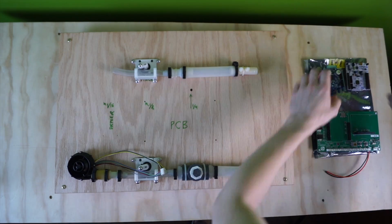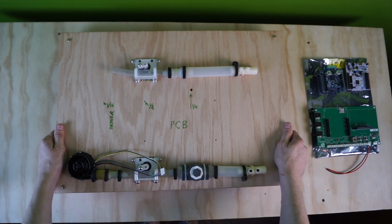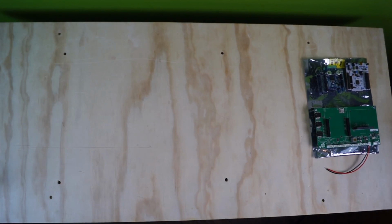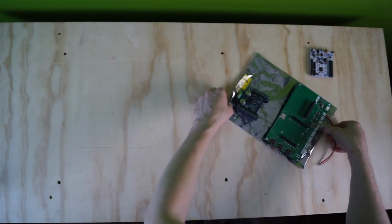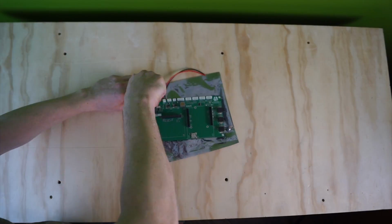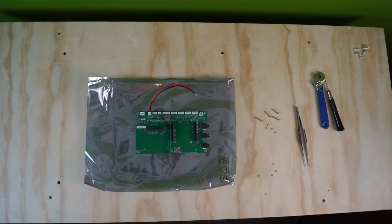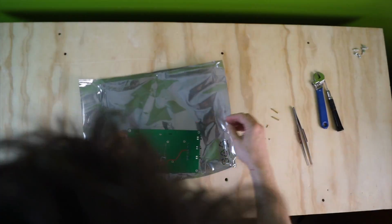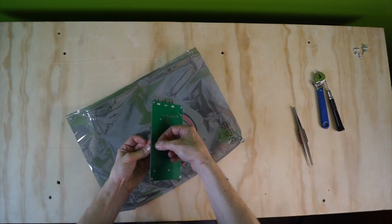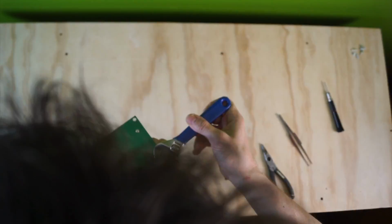Here's all the electronics, but we need to prepare them first. RespiraWorks has created a custom PCB to minimize production errors for the control system. Here, Martin is modifying its mounting for the development prototype. The board links the Nucleo controller, pinch valve stepper motor drivers, blower driver, sensor inputs, and touchscreen controller.